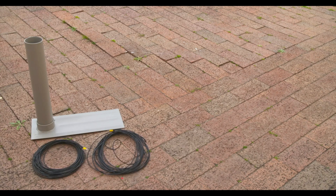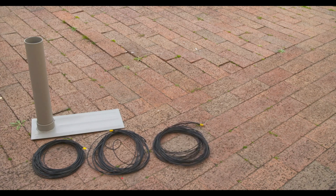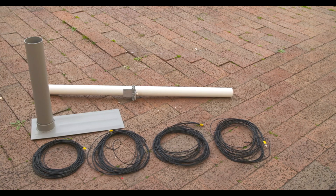We've got some radials about 4 metres in length, and all up we're doing about 20 radials. Experience has shown that once you start to go over about 20 radials you don't really get any further effectiveness, but there's a sweet spot there between about 16 and 20.